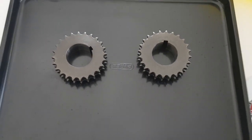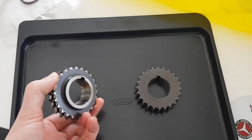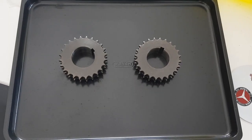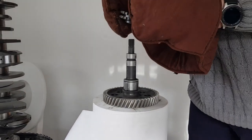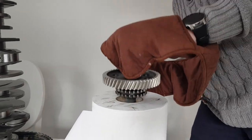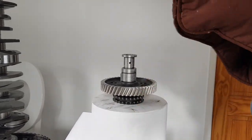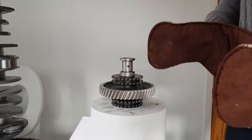Here are the two gears ready to go in the oven. They're an interference fit on the shaft, so they're going to be heated up to about 150 degrees C before I try to put them on. At the same time I've put the shaft in the freezer so it should be well below room temperature when I try to fit these. The shaft is now ready, so I'm just going to very quickly drop the gears on — just have to line it up, push it on, make sure it's firmly down, and quickly turn it over and do the other side. The shaft has been in the freezer so it's down to about minus 20 degrees, and the gears should be around 150. That's those two both done.